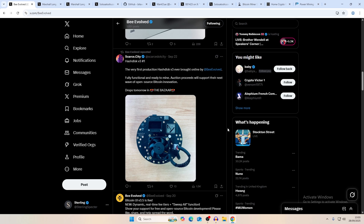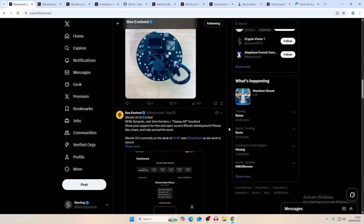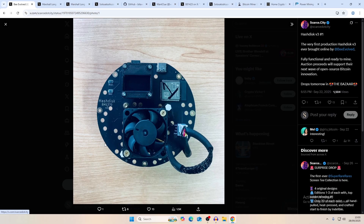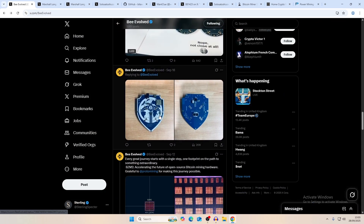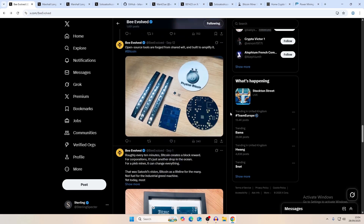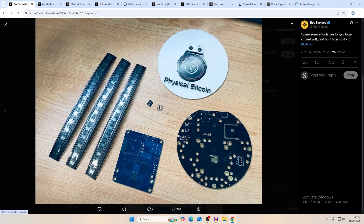The Hash Disk is mainly for heating purposes — you put it in a pipe, blow air through these holes, so you can have four or five of them with heat exhausting out the front to heat something useful. It's made for a certain pipe diameter, has a chip underneath and an LCD — though the LCD seems odd if it's going inside a pipe, so you might be able to remove that — plus a fan. If you had five or six stacked up, you'd have a bigger fan the size of the disc. There's also the BitAxe Shield, which is a rework of the BitAxe design.